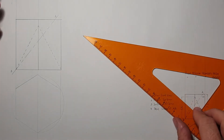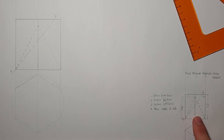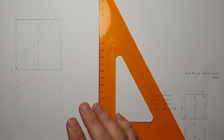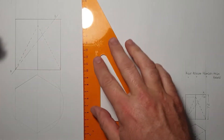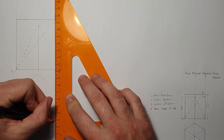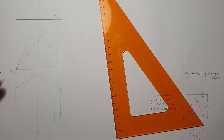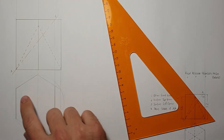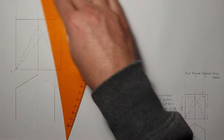That's my given front view, exactly the same as in the question. Now I'm going to look at the cutting plane. When I have a prism and it cuts through either the base or at the top, I can bring that line straight down and draw in that line. That's where my cutting plane actually cuts through the prism. It also cuts through the corner over here, which are these two sides, and I can draw in the rest of the prism. The pyramid is going to be a different story though.